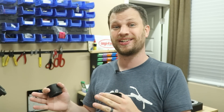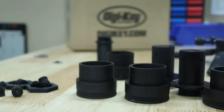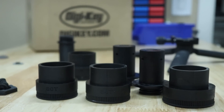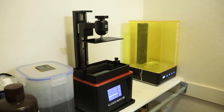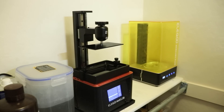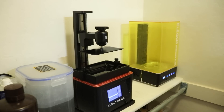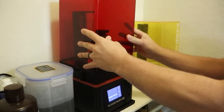Bad news — I overcorrected. The 80 tooth and 84 tooth pulleys are too small and there's no way I can take up the extra slack. So unfortunately I have to do another three-hour print. The cool thing about resin printers is that there's no penalty for more items on the print bed — the time just depends on how tall the tallest object is. So I've got a 90 tooth and an 88 tooth pulley printing now. Fingers crossed one of those works — it's getting late in the evening.